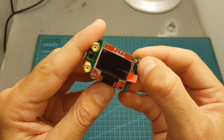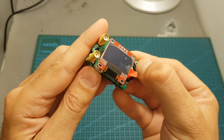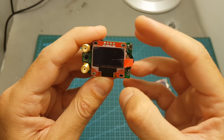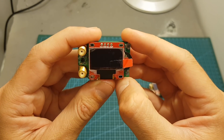We can find a boot button which enables you to put this receiver into boot mode. If you press this button while connecting the micro USB port to your computer, you'll be able to flash new firmware using the Betaflight configurator — you can just load a new hex file and flash it using the Betaflight flasher, which is quite simple.